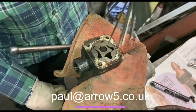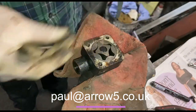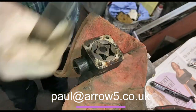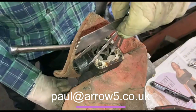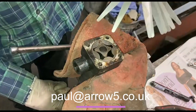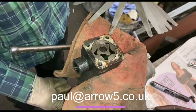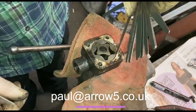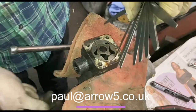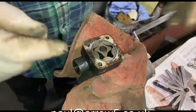That's 0.06 and you can get that past easy. You can even get a 0.07, and an 0.08, and a 0.09 — so this is worn and I wouldn't use it. Again the bit on the outside, you can get the 0.08 down the side, 0.09 anyway — so that needs new bits. There you go, that's what a worn one looks like.